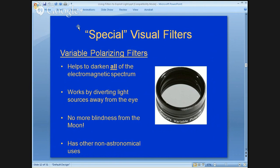usually injection molded clear plastic, styrene, has a lot more stresses than glass will. Although I've got one 8-inch blank that has a spectacular bullseye with cross lines in it in color. That is totally useless. But I don't know whether it has any annealing or whether it would blow up if you started grinding it. But it isn't Pyrex. Okay. So you can check out glass on that.